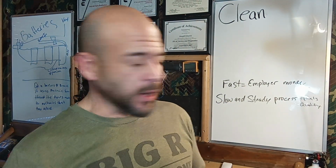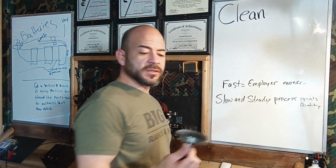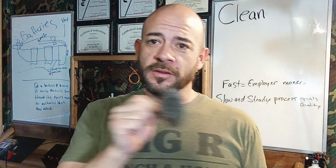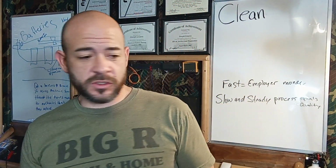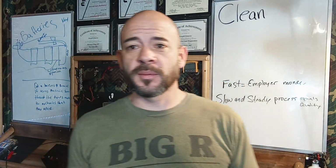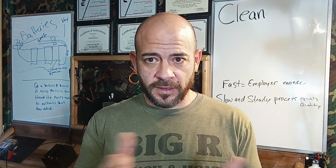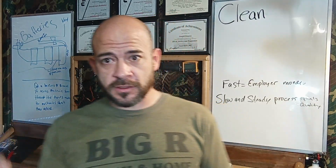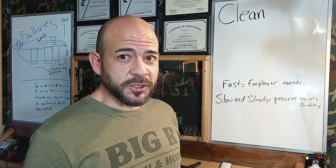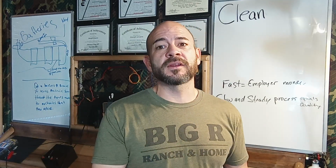So before I take things apart, especially if there's any rust present, I will take wire brushes and clean all of the fittings around them on the back side and the front, and I will squirt some lube on them. At that point, I will heat them up with a torch if it's just steel, provided that the hose isn't going to melt. A small torch usually won't hurt anything outside of the fitting itself, but there is transference, so we don't lay a big old oxyacetylene torch on, right? Just some heat. So with that heat and that lube and the clean threads, everything comes apart smooth.